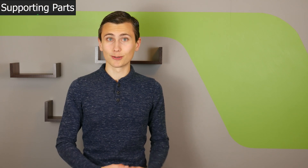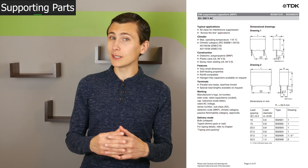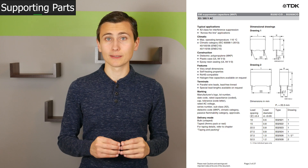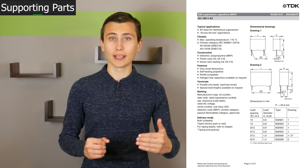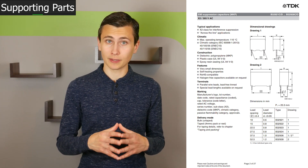We should probably also talk about the supporting components we chose, not just the controller. The input capacitance was selected to be two microfarads. We don't really need input capacitance on this converter since we're sourced by mains and there's plenty of voltage, but this probably ends up behaving more like a filter cap than bulk anyway. This is provided by two one-microfarad film caps, and assuming a series resistance of around 25 milliohms, they'll be dissipating some power. With approximately 2.8 amps of ripple current, that leads to a power dissipation of approximately 0.2 watts — only 0.1 watt per capacitor.